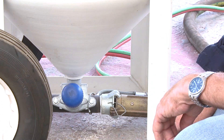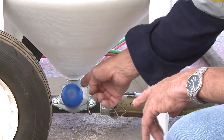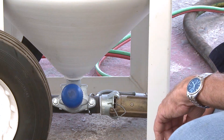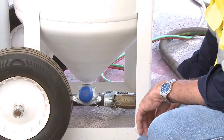So what I normally do is, with that valve I'll wind it in until it stops, so that means that the piston in that valve hits the seat. And then what I'll do is I'll wind it back three and a half to four turns. That gives me an indication of somewhere where I need to be in the realms of how much grit flows through.